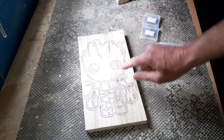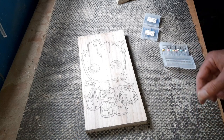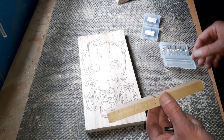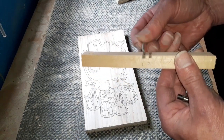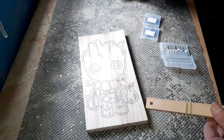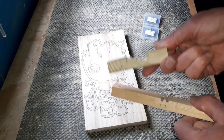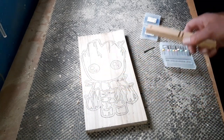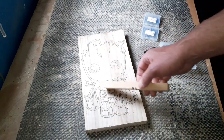Depth-wise, I'm working on about three millimeters — the same thickness as one of your CNC bits. I made myself a little mark there. Obviously that one's a little bit too deep and that one's just about right, so we can use that for further reference. Back in the day I made a little gauge of different depths. If you want to go a little bit deeper, you can also purchase depth gauges off eBay or Amazon, but why bother when you can just make a simple thing like that? It literally just slots underneath the router and we set it to that depth.